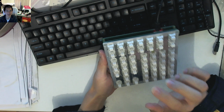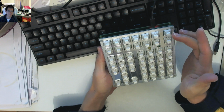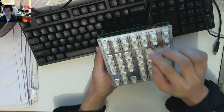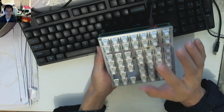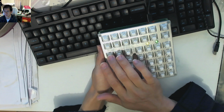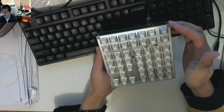I've electrically tested the circuit lines for both layer 1 and layer 2, for both LED 1 and LED 2, and they are separated. They are actually separate. They're not interconnected. So I don't quite know what's going on with the programming that's causing both layer 1 and layer 2 status to be showing that. It might be a QMK thing, I don't know.